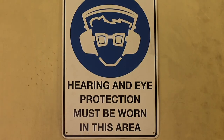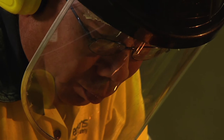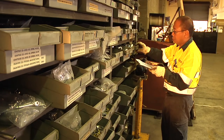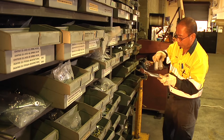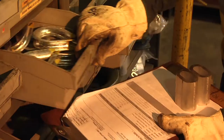If you are required to cut the rope using a power saw, you must be given training before using the device. Your job sheet also indicates what size ferrule is required and any fittings needed for the eye loop. In this demonstration, a thimble will be used to allow a hard eye to be produced.